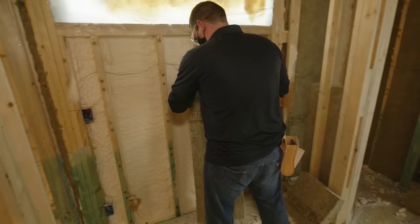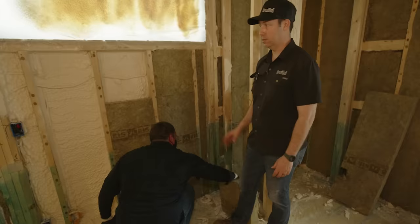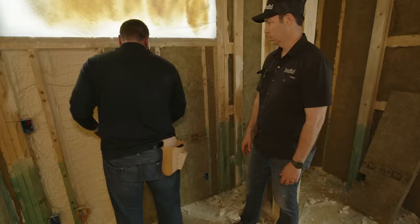You know, a couple other benefits of Rockwool, I've used a lot of it over the years. Ken mentioned the sound. It really makes it a very dead sounding house. Kind of like a recording studio. And in fact, my studio at the office that I podcast in has Rockwool that I've just covered with some filter fabric. The other benefit is there is some additional fire resistance here as well. Now we're gonna be hanging sheetrock, which also gives fire resistance. But if something were to happen in that cavity, that Rockwool is gonna give us some additional fire benefit as well.